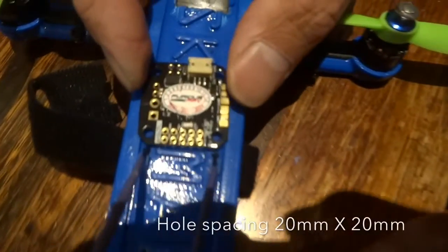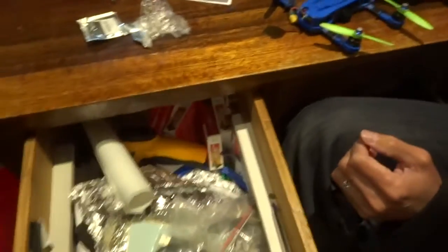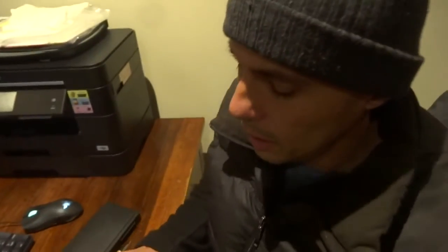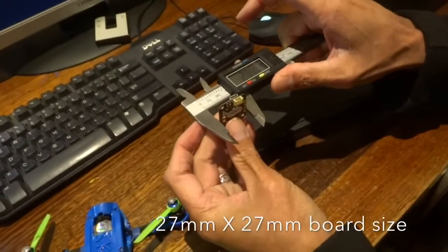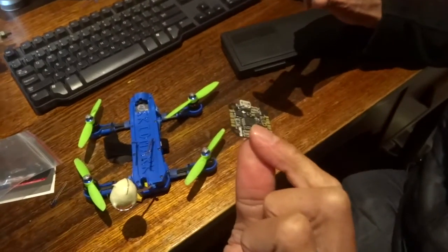With the new Pico, what are these things measured, Derek? 20 millimeters center-to-center hole spacing. Let's pull out the old one for reference and measure this little sucker. The hole spacing is 20mm square. The old one is pretty much the width of the Skidmark — 36 millimeters. This one? Drum roll... 26.8 — that's 10 millimeters smaller! How these guys fit this all in is beyond me.